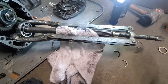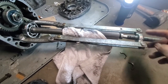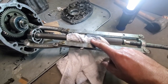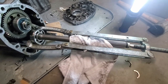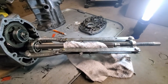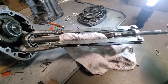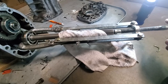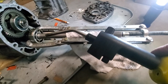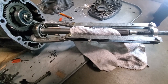This is how I made my special extended jaw pullers - I added two pieces of metal and made sure all the holes were drilled in the same position so it's all even. I tightened it up with a rag around to protect the shaft and I'm pulling off that bearing, slowly turning with a big extension and socket, using a rubber mallet to keep it straight. I'm also using a little bit of heat on the bearing - I'm probably going to replace these bearings anyway, so just be patient and work it out slowly and carefully.